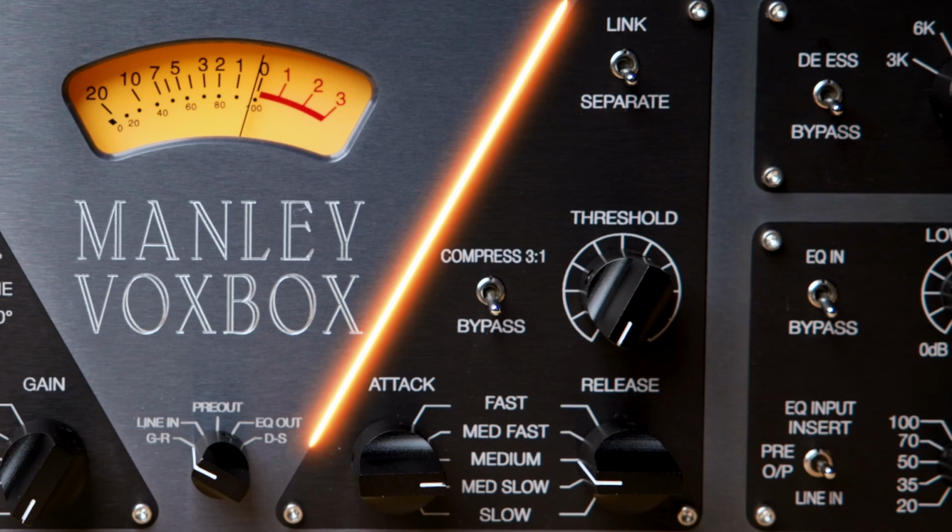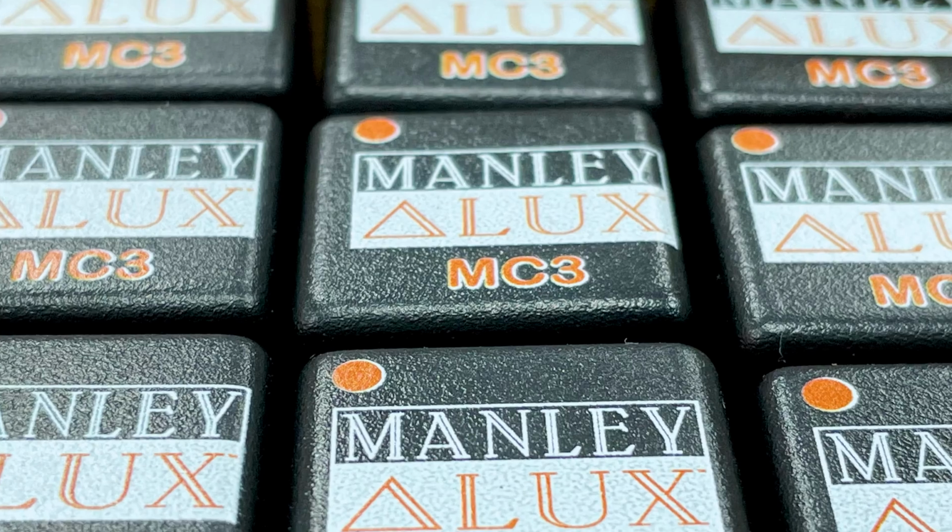The compressor section's kind of like an LA2A. It uses some signal that we derive from the output, and it drives an LED inside a light, tight case that shines upon an element that changes its resistance according to how much light is hitting it. Those used to be commercially available in these little packages. They became obsolete, so guess what? We had to roll our own.